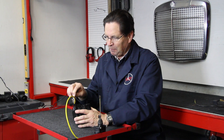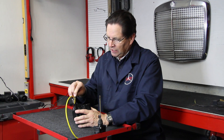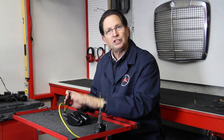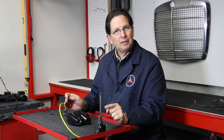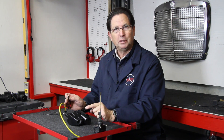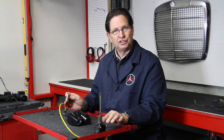Watch here as I make contact — it pulled the actuator down and shut the motor off. Then I'll touch the other contact point — it runs the actuator up and shuts the pump down. This has shown me that this pump is in good operating condition and the actuator is also good. If the actuator has a leak in it, it may move but the pump may not shut off — that's a good indication you're going to have to replace that unit.